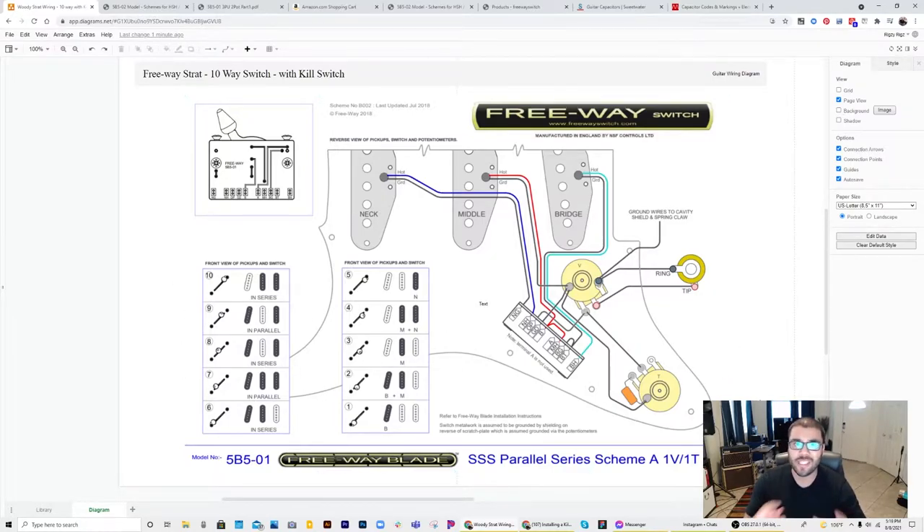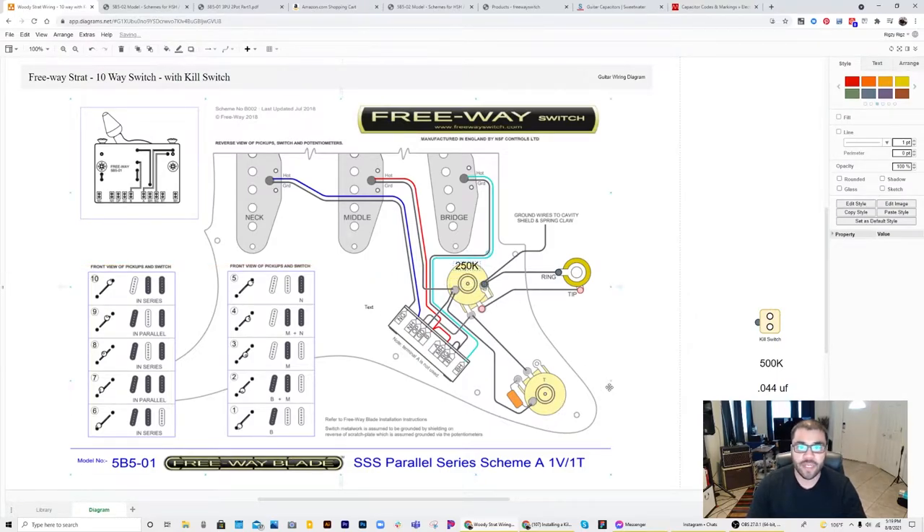In order to support all of these sounds — really high output series sounds and some high and lower output single coil sounds — we're going to need a versatile setup. Our potentiometers might be too dark at 250K. So I chose to keep a 250K volume pot at the top because we mainly want to use this as a strat and tame the highs of the single coil pickups. However, we want to use a 500K tone pot because 500K pots bleed less noise into the ground due to higher resistance, so you keep more of your sound.